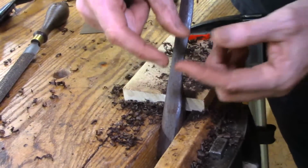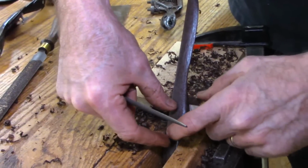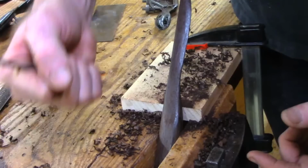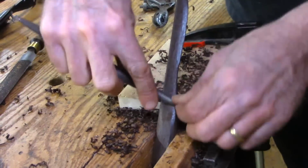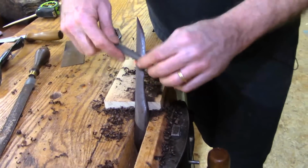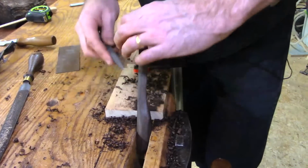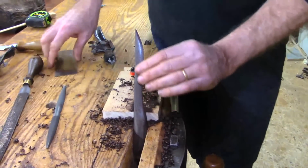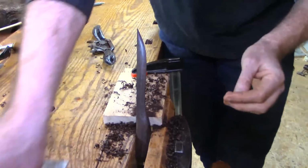I would probably cut my shape in the inlay material, like the mother of pearl or whatever, and then usually you can double stick tape it there and knife around it, and then you can plunge out with a small bit and chop to the knife edge, and then you're going to epoxy it, or I always forget the name of that glue. What's that? Star CA glue? CA glue, yeah. Star Bond? That's what I used on the guitar neck. It worked beautifully. Plus you could use dark brown or whatever if you had any voids, and it would fill the voids. Okay, so then I would now card scrape.